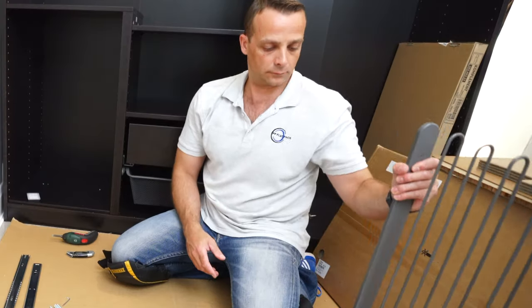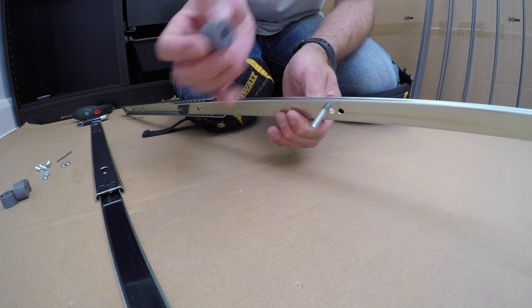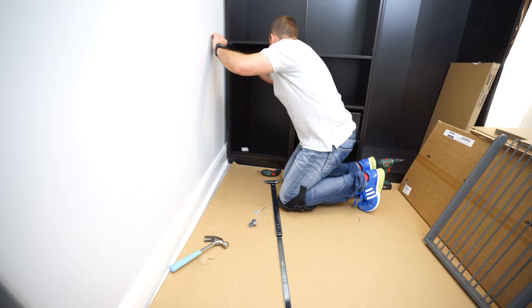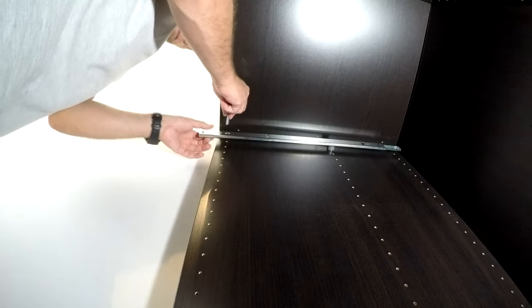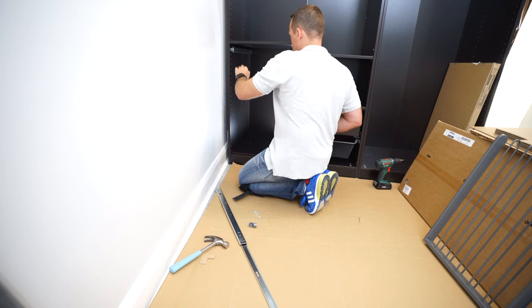Now prepare the rail first. It's going to be the first hole - depending on which side you're looking from, left or right. Check in the instructions which hole it is, this is quite important. Then place the washer on top of it - I find this way easy to install because you can go straight on the hole with the screwdriver ready, so the washer won't pop out. Secure it in the middle first. Now find the hole through the rail - you're going to have to close the rail. Find the hole and put the washer under it. The washer sits between the rail and the wardrobe. Push the screw through this hole once you close the rail, because the rail doesn't extend that much. Once done, check for smooth movement in and out.